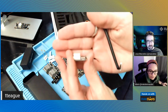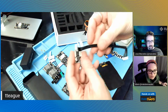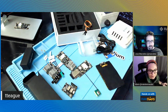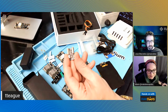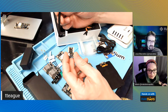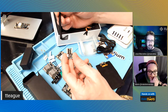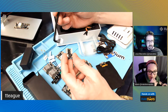That's to connect to those special cables, it's a way to get your signals out of the box. So if you put it in a box, we had I2C and UART, and we had all those protective circuits. We have an eFuse there, and I think we have some more protection there, so if you connect into something outside the box, that's in the wild, like you can get wet and things like that, it just keeps everything protected.